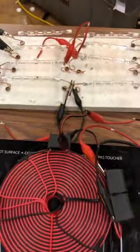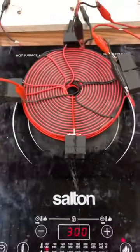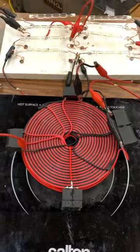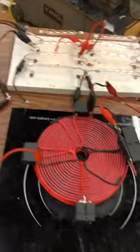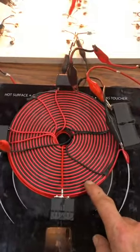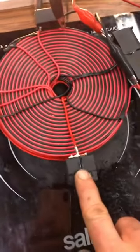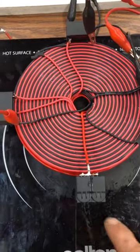So 300 watts driving three kilowatts in load, pretty much close to full brightness. I tried everything to tune it to get four kilowatts — it lights them all but they're not that bright. So I opted for three kilowatts. This is the 240-volt unit with two feeds: two kilowatts on one feed and one kilowatt on the second feed.